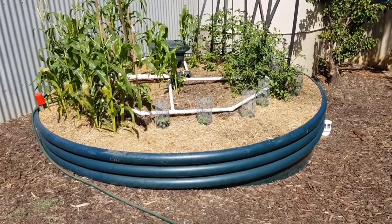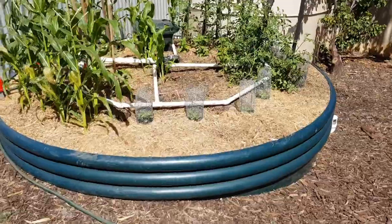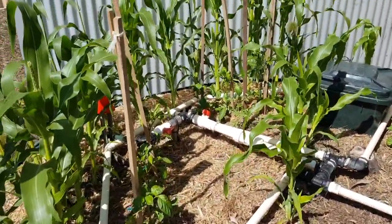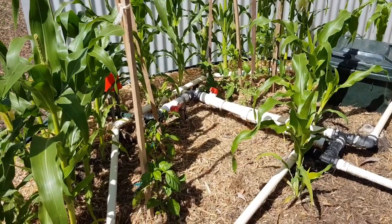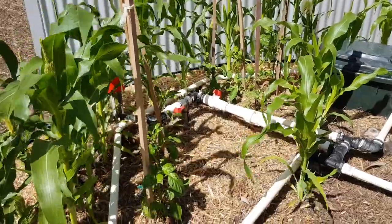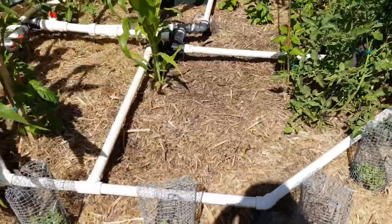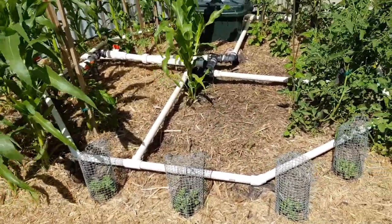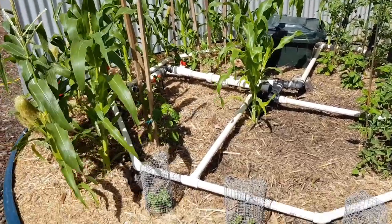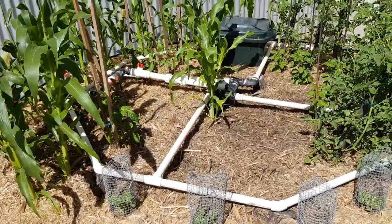So I pump it right out and leave that pumping for about half an hour to an hour. Then I come back — the pump's obviously on now — it's got a float switch on it so it won't overrun. That's the configuration for pump-out: just flip those valves around and it pumps out onto this PVC ring. The pump sits down in a sump underneath there as well.